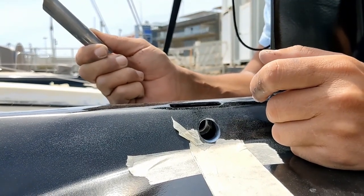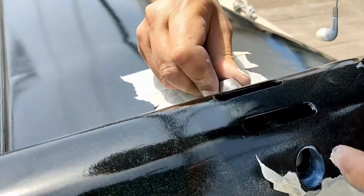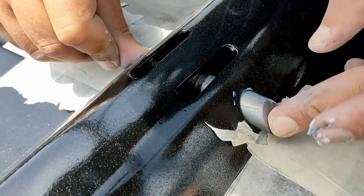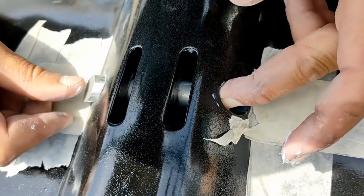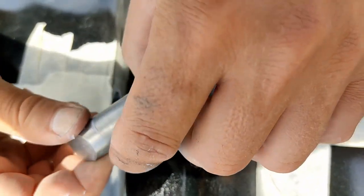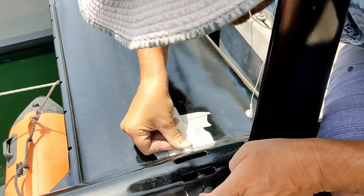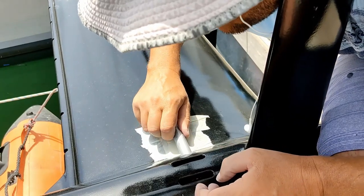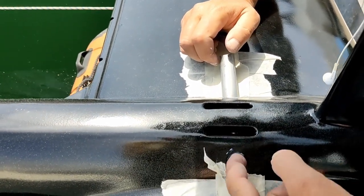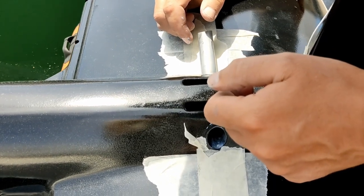It's probably worth mentioning, isn't it, that carbon doesn't like metal. Yeah, carbon and metal don't get on very well at all, particularly aluminium. It will produce rust stains very, very quickly. Even my nitronic rod here, which is not known for rusting that well. Because of the dissimilar materials and the salty environment, galvanic corrosion happens very quickly when carbon's involved. If you have aluminium and carbon touching and the aluminium is bare, like unanodized or hasn't got any teff gel or insulator between it, that aluminium will not last.